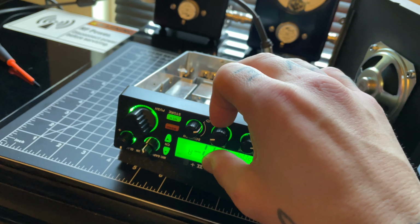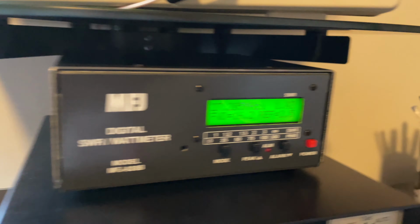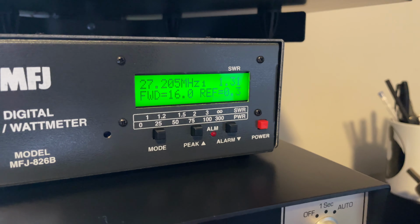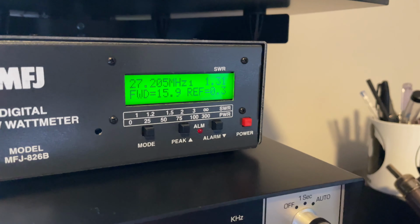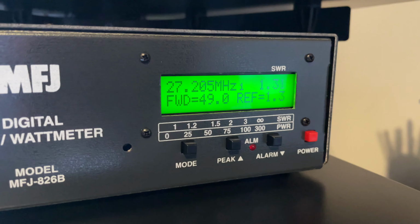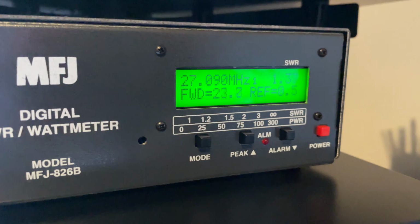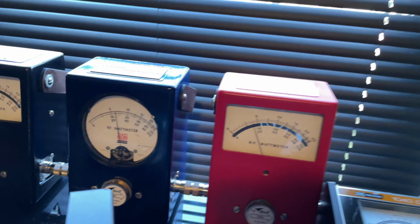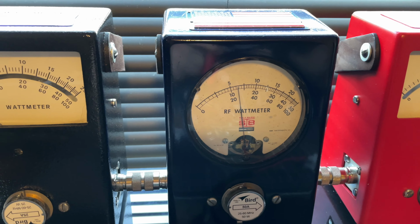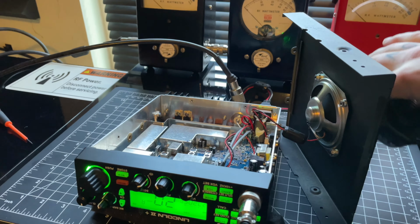We'll come back here. My gain is still all the way up. Now we just put the RF power all the way up. On the high side, you got a 16 watt dead key. Three-quarters of a watt of reflect, which is nothing. Audio. Black Ops Technology, audio. Average power, 100 watt scale, 50 watt scale, 25 watts in reverse. Yeah, man, this thing's stroking.